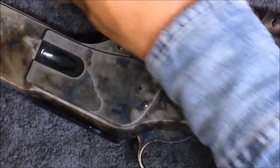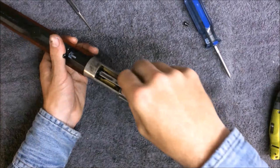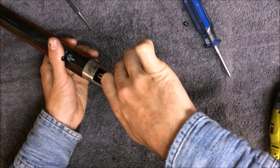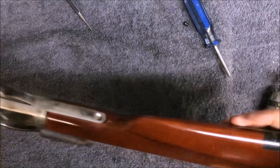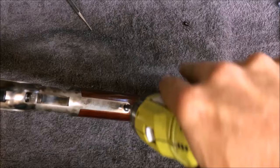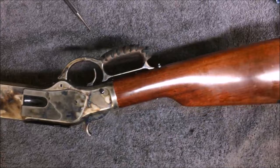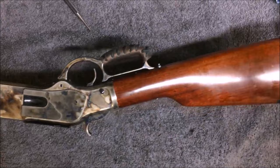One of the most important things about bolt tabs is carrier elevation and the lifter spring, which holds the carrier in its full upright position. If that lifter spring is too weak, there's nothing to hold the carrier up at full elevation, and then the bolt tab is exposed to the rim of the case. The carrier can also bounce off the top if the spring isn't strong enough. A lot of people like a very light lifter spring, but it is really not a good deal.